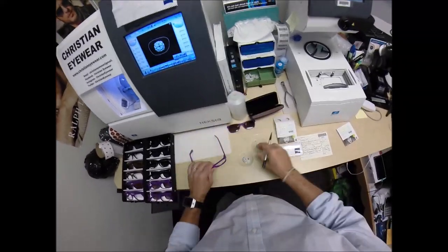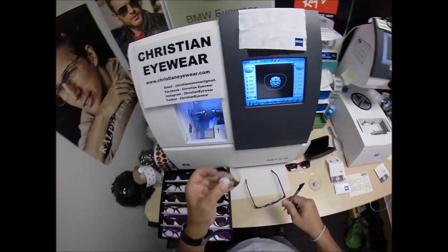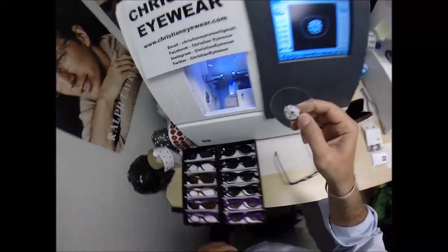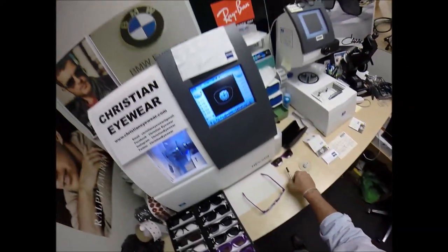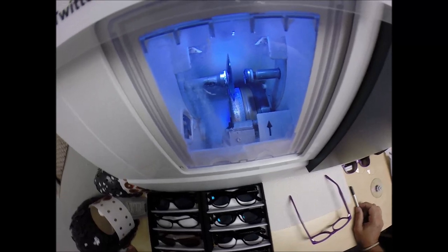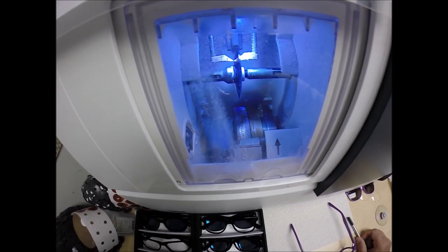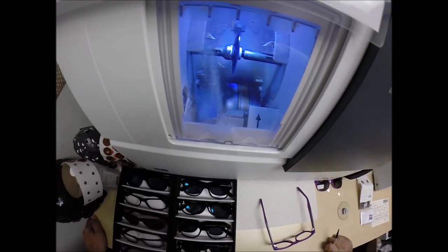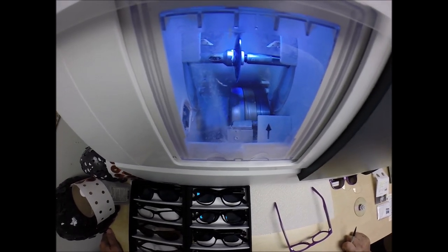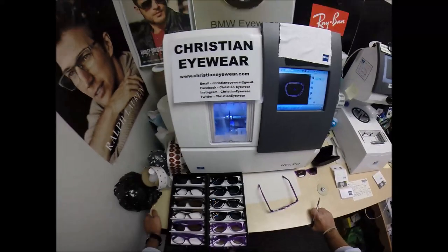I'm not going to put a safety bevel on the front convex surface, but I am going to place one on the rear concave surface — I'll explain why in a moment. The magnet's going to attach itself to another magnet there in the chuck. Hit the green start button, the door closes, the clamp shuts. The lens will be traced by two white styluses, making sure it's large enough to fit into the right side of the frame. You can see it tracing the shape of the right lens, and just like the old carpenter saying, measure twice, cut once — it's measuring the thickness at every point to know precisely where to place the bevel so you have the least edge thickness showing.